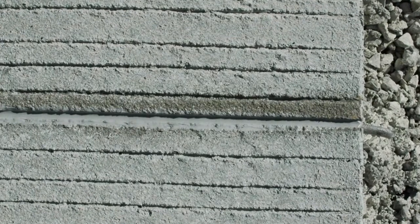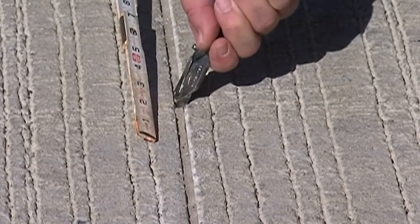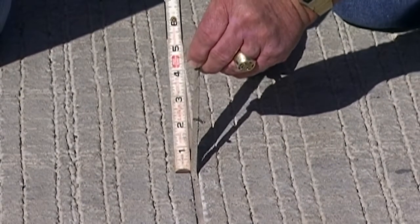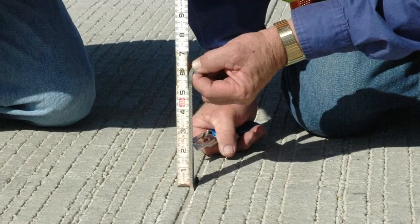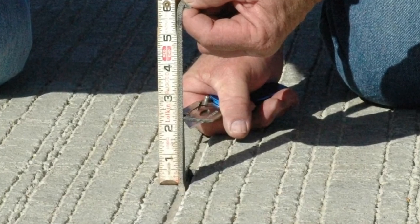Small spalls or difficult joint interfaces can be touched up after tooling if required. The sealant's curing process will be complete in 7 to 21 days depending on the weather. After the sealant is cured, you may want to spot check to visually and numerically test the sealant's adhesive and cohesive characteristics. Cut the silicone sealant perpendicular to the joint and along the joint walls for about 2 inches. On this cut tab, mark two lines approximately 1 inch apart, then pull the tab upward at 90 degrees from the pavement. At 450% elongation, or 5.5 inches, there should still be no cohesive or adhesive failures. This cross section should also be examined for thickness of the final bead, shape factor, and width to depth ratio.